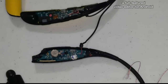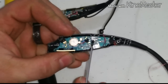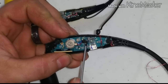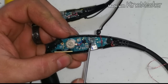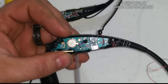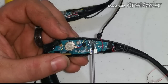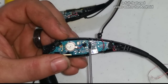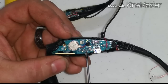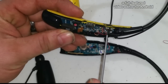Now there's another issue I'd like to clear up about the power switch. I'm not sure if the power switch is replaceable because of the very small solder contacts. If you could find this switch, eBay would be the best place, or a local electronics shop or RC hobby shop might have one. There seem to be about seven solder points on here, making it a very delicate operation. If your power switch is bad, you might want to consider replacing the whole board with a new one. The power switch is the same on the HBS 750.